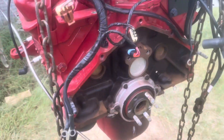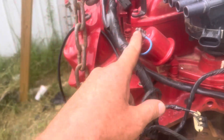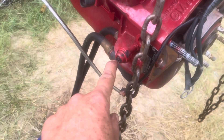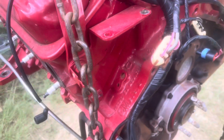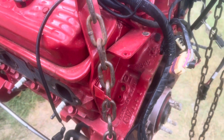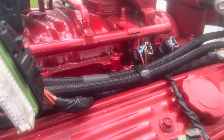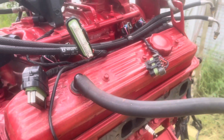This is your alarm horn for your low oil pressure and over-temp — that's all there is on Volvo Penta, they don't have a reservoir alarm. The harness goes this way like a halo off the top of the engine, but I've got a chain on here so I can't lift it off that way. What I'm going to do is take this bolt out, take the horn off, peel the harness off going that way, and bring it back around. The PCV hose is plugged in right here — it's already off, so I can pull that out of the way.